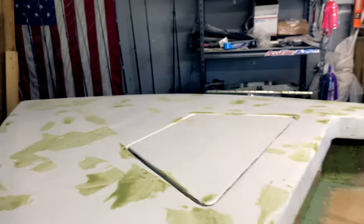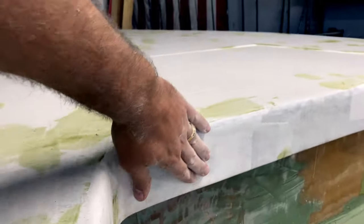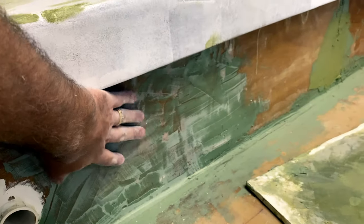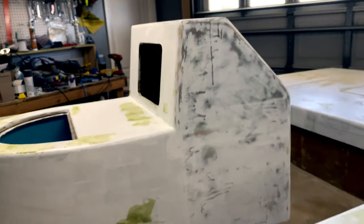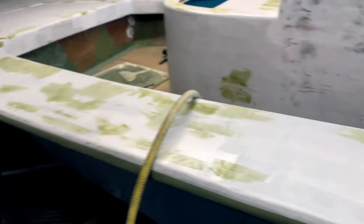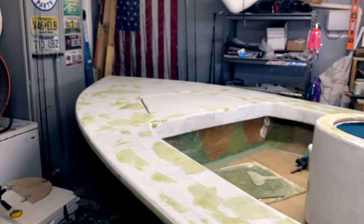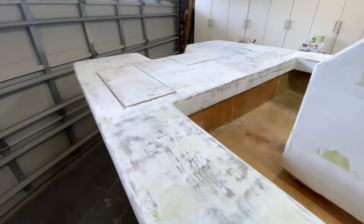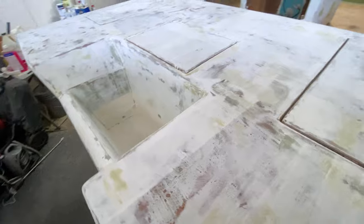The console, these boards, and these walls are all you're going to see, so I'm going to work really hard on those and make them nice and fair and perfect - mirror finish. But the top I can just keep knocking down with 220 grit and get ready to go to finish primer. I've done a full coat of high build and sanded the whole top side with 220.